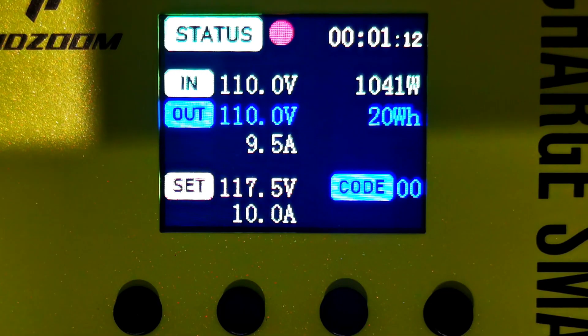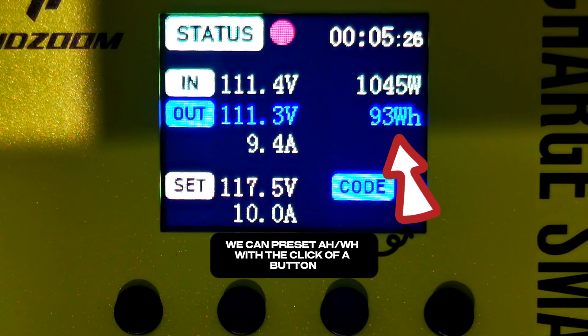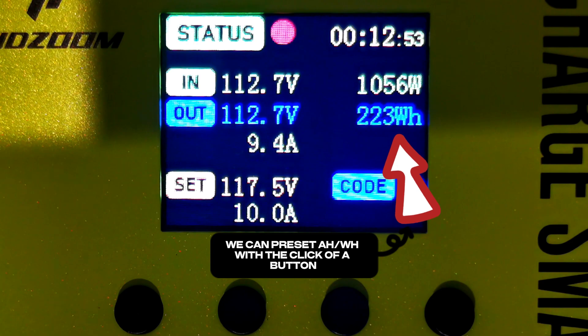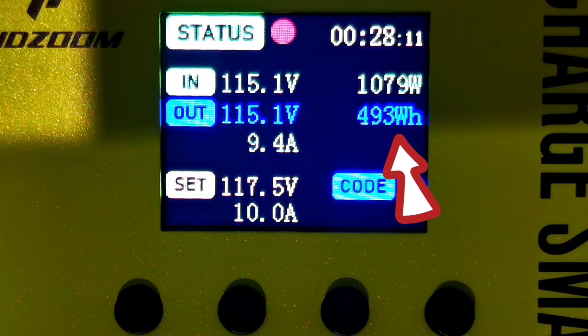The second reason would be to evaluate the decay of the batteries. We can charge our batteries from, say, 50% to 100%, see how many amp hours or watts have gone back into the battery, then take that away from the battery total watt hours, and we'll actually be able to dictate a percentage of how the battery is performing. Anything under 80% means the battery has gone too far and you're going to have issues — it might be the BMS, cell balancing, or even some dead cells. Basically it's going to be unhealthy and you'd probably need another one.